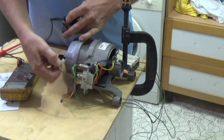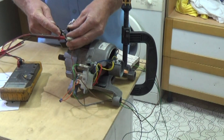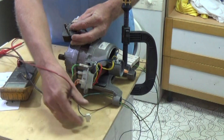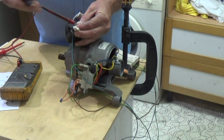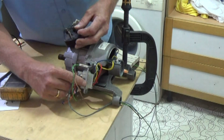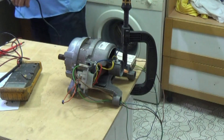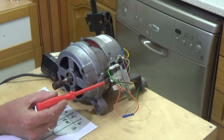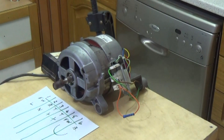What I'm doing here is chasing the wiring through using continuity, making sure that I've got everything correct before powering this motor up. I know I'm checking the wiring three or four times but I'm emphasizing the fact that you do need to get this wiring correct without mistakes before you actually start the motor. Safety is always our main priority. So one last check and then we'll fire the motor up — that's our link on number five and six, our power feeds live and neutral, and our earth, which are all being checked.